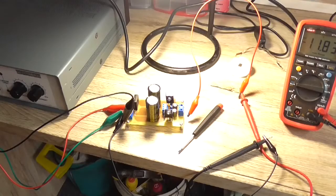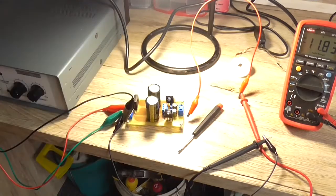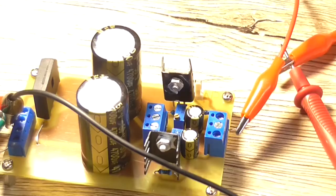Yep, I know my problem. They should have been 120 ohm resistors, not 240. I don't have any 120 ohms, so I'm going to use 150. A little higher won't hurt it. However, getting those resistors back out might prove a little bit challenging, because there's one buried where this regulator is. So, fuck. Okay, with those two resistors now changed to 150 ohm, let's see what we get.